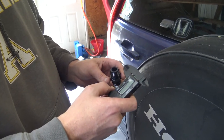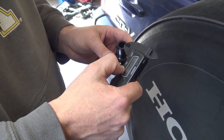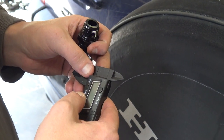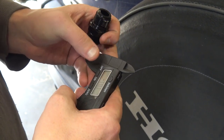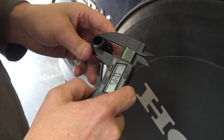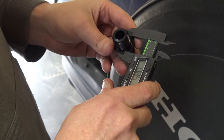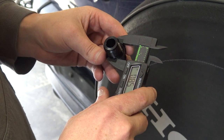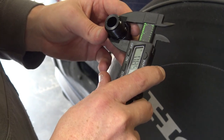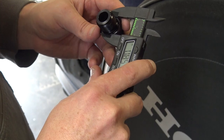We're going to use a digital mic here. We're looking at 0.85 — just over three quarters of an inch. That's actually on the back lip there. So let's find something on the unibit that'll do between three quarter and one inch, and we'll pop a hole in it.